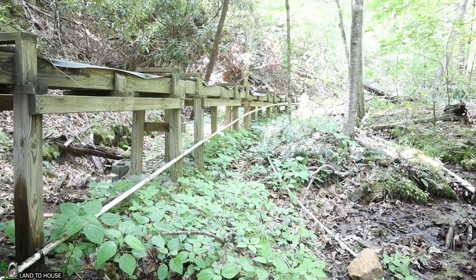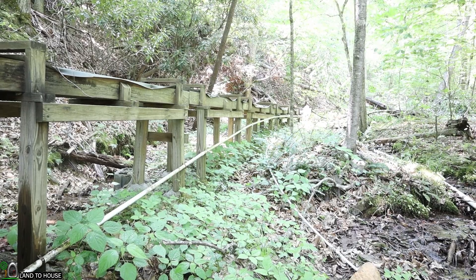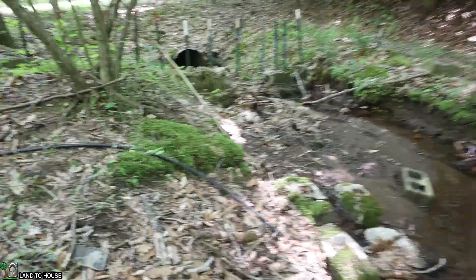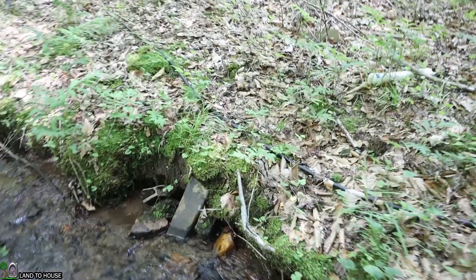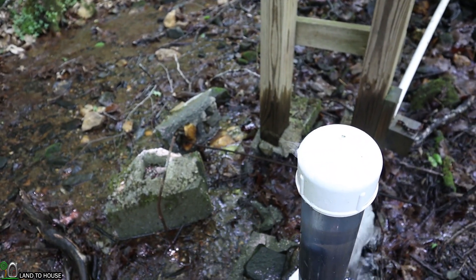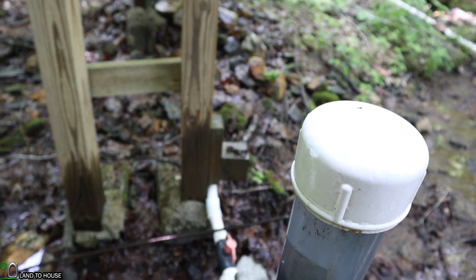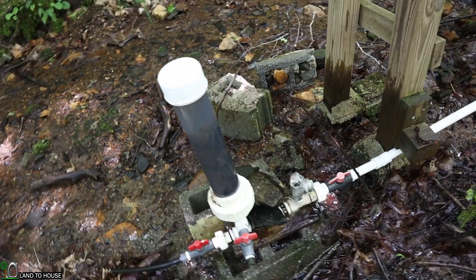Let me show you that real quick. First of all, you can hear the drive pipe is making a cracking sound all the way up. Next, you can see the drive pipe is bouncing more than it should. And then another sign that's really indicative of hitting hard is the delivery pipe jumping — that shouldn't be. There is a small squirt of water coming off the back side of the pressure tank with every cycle. That means there is a crack right here on the tank, letting a burst of water out, which means it was letting out a burst of air every time it was hitting before that.